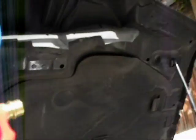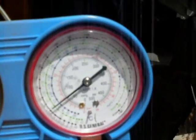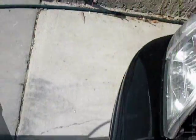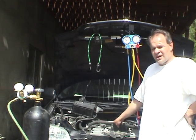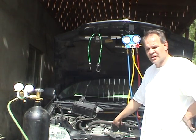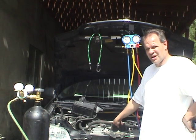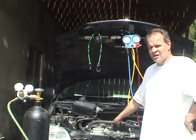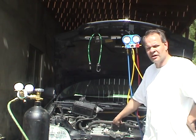This gauge has gone down to 50-60 psi and it's going down and down. There you have it — how to find air conditioning leaks using nitrogen. You don't want to use compressed air because compressed air has moisture in it, and introducing moisture into an air conditioning system is bad. I'll let you look up why moisture is bad in an air conditioning system.